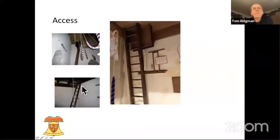This applies also to access into the ringing room itself — make sure that there are handrails above the ladder so that people can do what you're supposed to do: walk on your feet up the ladder until your feet are level with the floor, and then step off sideways. Where there are no handholds and people are facing the wall doing a bottom shuffle, that's the place where you're likely to get slips and stumbles. A couple of nice handrails where you can go straight up, step off sideways — job done.